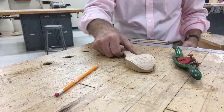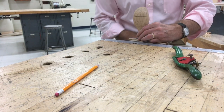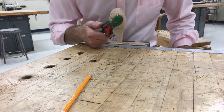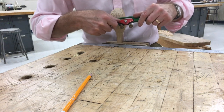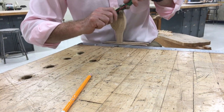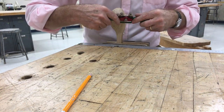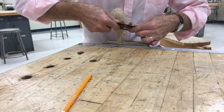It's going to look like this when you actually start using the spokeshave. You put the spoon in the vise. So, to cut in the correct direction to the top, there's the blade of the spokeshave — you're going to go up to the top and stop. It's cutting in this direction. To cut the bottom half, I'm going to turn it away from me, turn the blade away, and cut in the down direction.